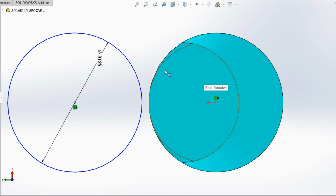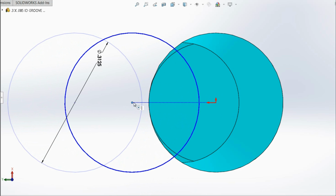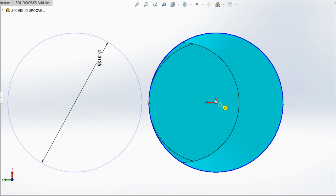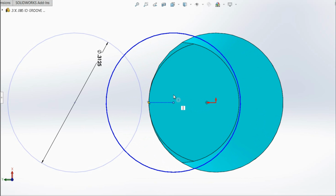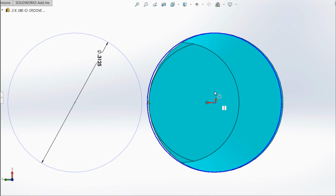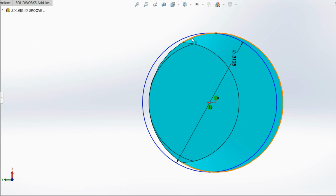Here I've turned off the actual carbide piece, so we're looking at the cross section of the actual extended bar here. And this is a 5/16 diameter hole, which happens to be the same as the boring bar main shank. And you'll see here by doing these two radii offset, we're getting the most distance vertically here. From here to here, we're keeping this beam as vertically high as possible, which is going to give it more bending strength in that direction.